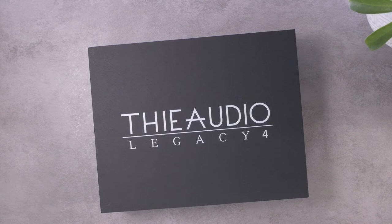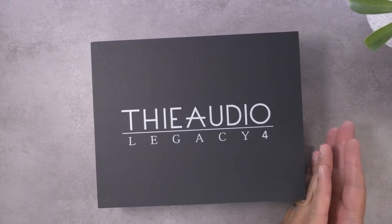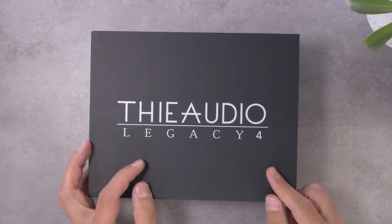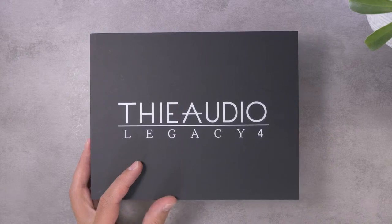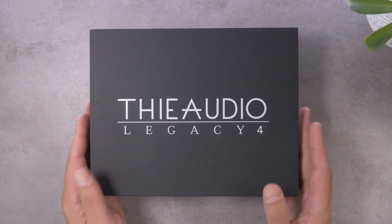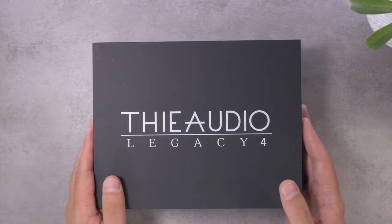But yeah, let me pull up my notes on this one just to give you a little bit of information. Again, shout out to Linsoul Audio for sending this one in for review. The Legacy 4 is, so I earlier unboxed the Legacy 5, which was a $250 IEM. This one is a little bit cheaper at $195. Like the Legacy 5, this is a hybrid IEM. It's got a single dynamic driver, but here we've got three balanced armatures rather than the four balanced armatures in the Legacy 5. Again, I wouldn't make my purchase decisions or pricing decisions based on the count of drivers that you get for your money, but it can be indicative of how much control the IEM tuners and designers had over the frequency response, which we will see in a little bit.